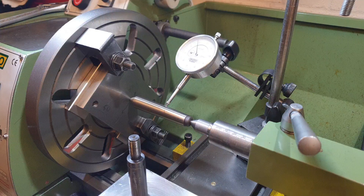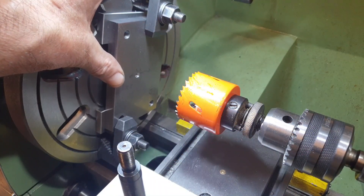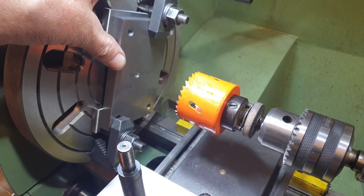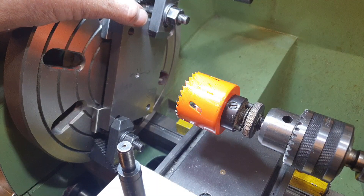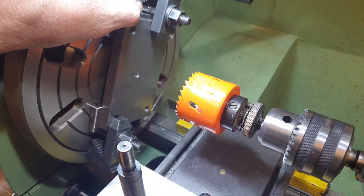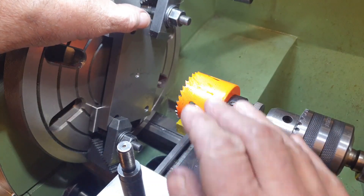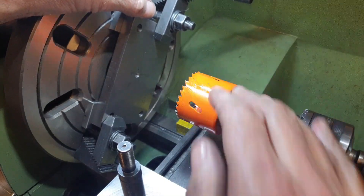I've centred this crudely using my normal setup of the floating dead centre, and managed to get it to about 0.05mm, which given what I'm doing is not going to be an issue. I need to take a hole all the way through at 61mm diameter, and then effectively put a counterbore of 72mm to a depth of about 8mm. The quickest method I can think of to open this hole up quickly is to use a hole saw — it's 54mm — so if I can get this all the way through it'll be a simple exercise of boring it out to the correct diameter.